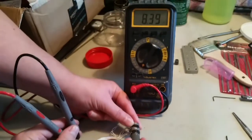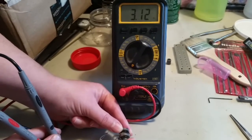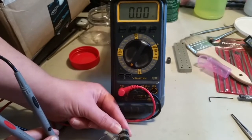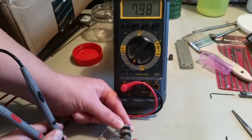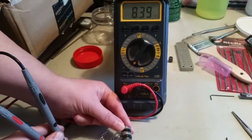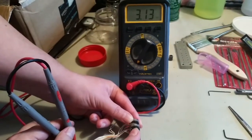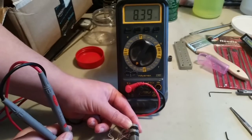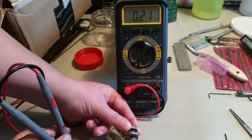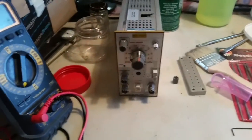Go ahead and turn that pot there. As you can see, it's fairly smooth — no dead spots, no opens, nothing — and it goes down to zero. Turn it back the other way, and the same thing. So this pot on one leg is good, so let's get the other leg. So now we're on the other leg — we did the outside pin, now we're doing the two inside pins. Go ahead. As you can see, it starts off at zero and it should go up to around 8.3k — it's supposed to be a 10k pot, but it's not. Go ahead and go back the other way. No dead spots — so that's a good pot. All I have to do now is go ahead and install it into my PG-502.